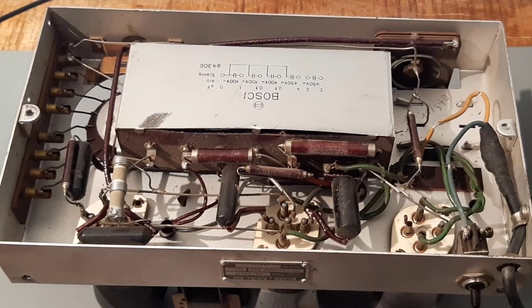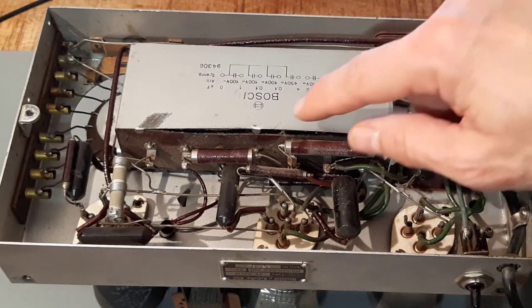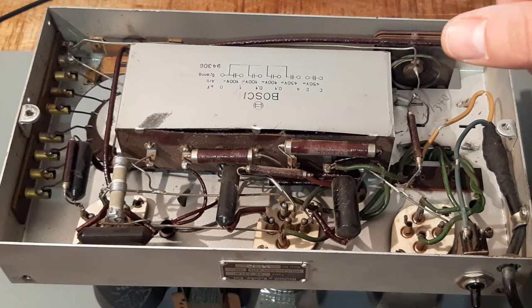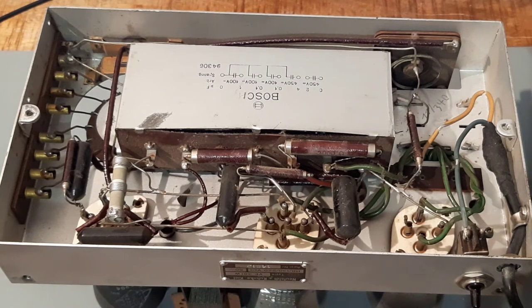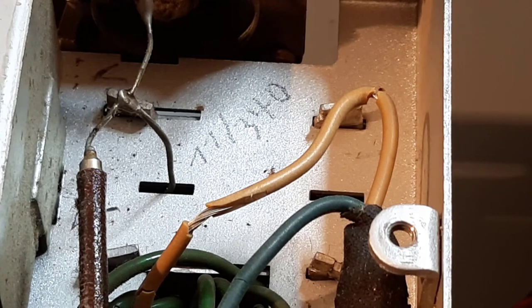I put it upside down and I can see some of the wires are a bit brittle — I have to replace them for safety. More importantly, the wax or tar in the capacitor bank is swollen. I fear that one or some of the capacitors in there wore out and became hot. Maybe an expert for old radios can comment below. There is also some writing like '11 340' on it — is it a serial number or the date when this radio was made? November 34? Maybe you know — just tell me.